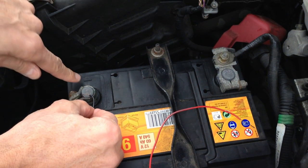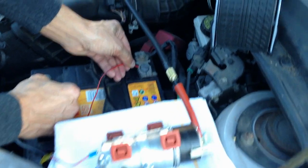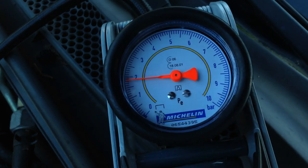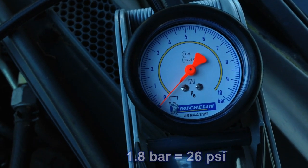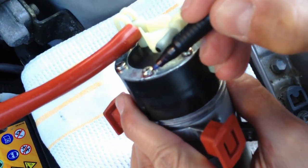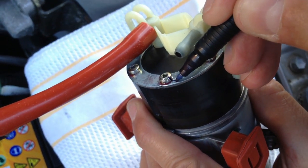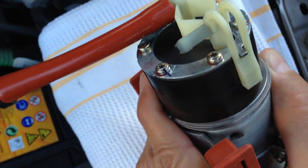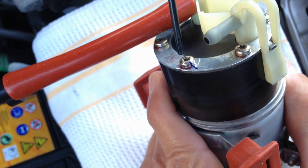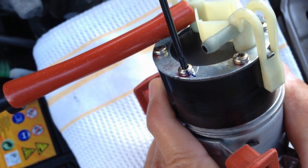Make contact between the black wire and the battery ground pole, and between the red wire and the positive pole. First test — look at the gauge. We've got 1.8 bar. This is not enough. So we are going to tighten the screws by 1/16th of a turn. I do a mark with a pen so that you can see that on the screen. Tighten the screw by 1/16th of a turn — like this, no more.